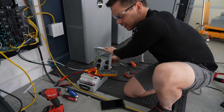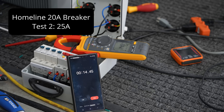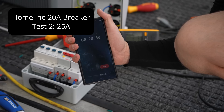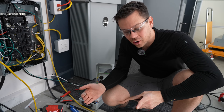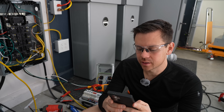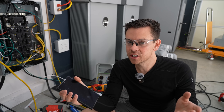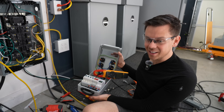Even with 24 amps, let's test that — it might take a minute or two, but it should trip. It took six minutes and 20 seconds. Now for every breaker, these thermal breakers, there's a certain amount of time and a certain amount of current it can handle, and you can look up that chart online. So let's see what the home line breaker data sheet says. The data sheet is useless, unfortunately. But you can look up different data sheets and it will show you how much time it can handle for a certain amount of current — but not with these Chinese ones.